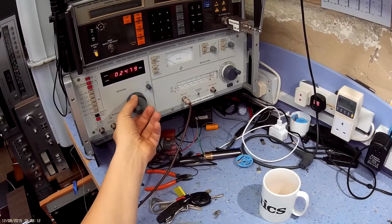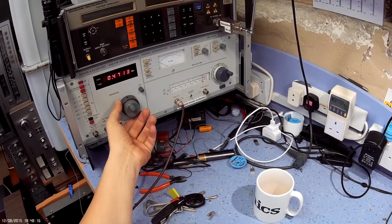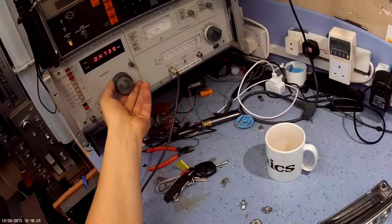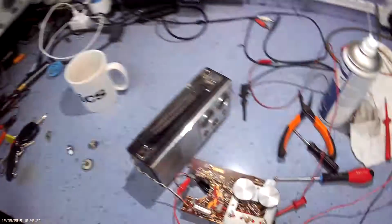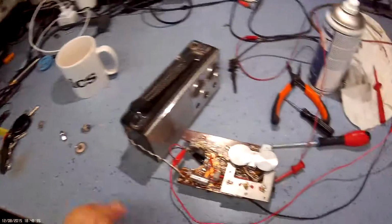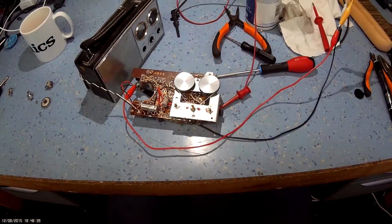It should be around 455, I think. 470. Okay, so that's around 470 kilohertz. It does seem quite deaf actually, because I'm putting quite a lot of power into there. So it might be an IF alignment issue. But I think what we'll do is try and sort this volume pot out, and I'll check a few of the capacitors, and we'll go from there. Thanks for watching.